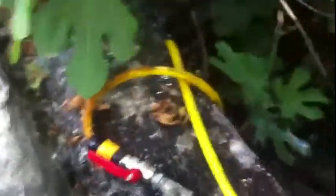When I open and close this valve manually — this valve controls the outgoing water — it also builds up very nice pressure in my pressure tank. So I don't know why it does not open itself up again. That's my problem: I don't get this negative drive. And when I open the valve, the water gets pumped up here, back up to the point I showed previously. My problem is it seems I have enough pressure from the water coming down, but the valve does not open itself back up.